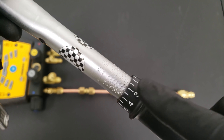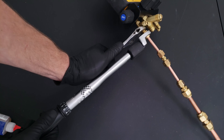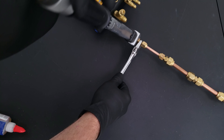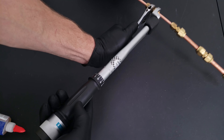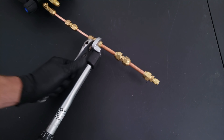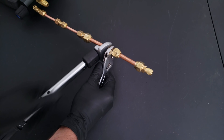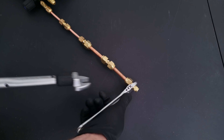Here you see our torque wrench set at 11 foot-pounds for our quarter-inch OD copper tubing flare adapters. We tighten that down until the tool clicks, and do that for every one of these joints. Then we set our torque wrench to 26 foot-pounds of torque for our 3/8-inch OD copper tubing. You want to read the manufacturer's specifications for the mini-split or air conditioner you're installing for the proper foot-pound torque values.